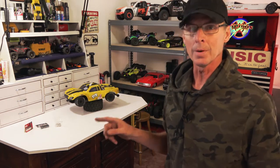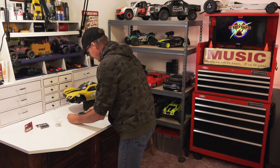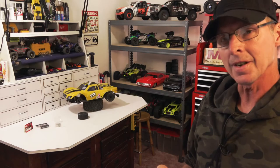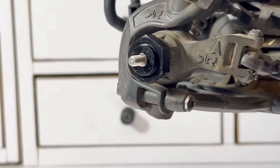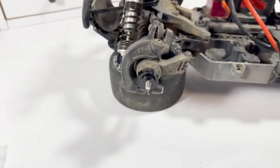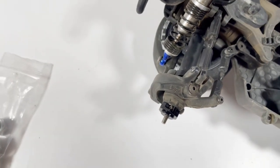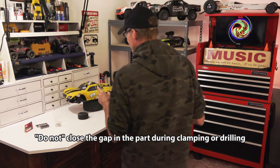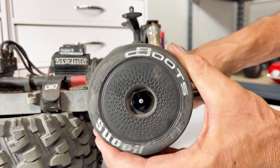Once you get this apart — there we go — this is the lug nut, and it's knurled with a nice smooth finish. It runs on the same spindle, which is really nice. This part right here has a split in it with a locking bolt. It won't slide directly onto the shaft because the collar is just a little bit smaller. But if you open that hole with a 3/16 drill bit — chuck it up in a vice, be careful, drill straight down through it — it slides directly on, hooks up properly, and tightens down for a nice solid fit. Nothing moves. It's a beautiful thing.